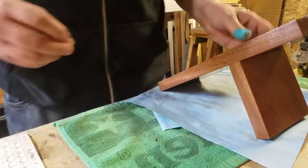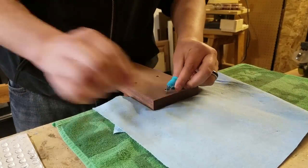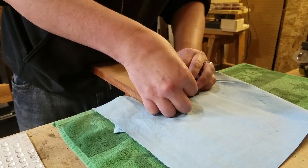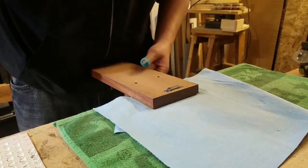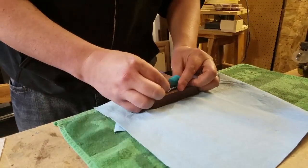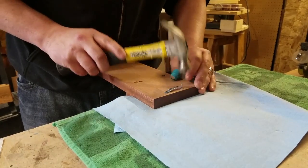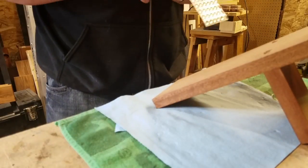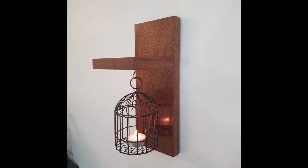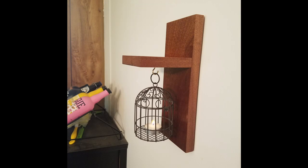That's pretty much it — that's the end of the project. Just to recap: we did about five coats of shellac, cutting back with denatured alcohol between each coat. On the very last step, I rubbed it down with fine steel wool, then applied a wax finish and buffed it out. I hope you guys enjoyed the video — don't forget to like and subscribe and follow me on social media. And a big thank you to David Picciuto for sharing your finish idea on YouTube. Until next time!